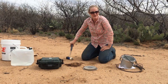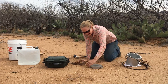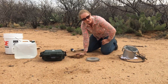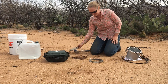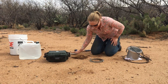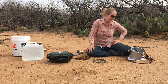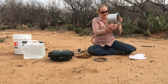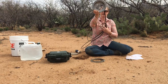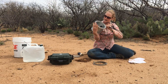This soil is pretty hard — it's not always that hard to put it into the ground — but what we have here is a real nice set where the ring is flush with the ground all the way around. I'm going to take the slam plate off and make sure that there's not any loose material protruding from the top of the ring that can interfere with the sensors inside of the chamber.